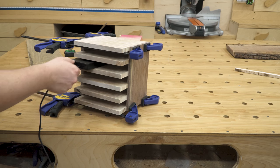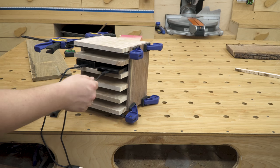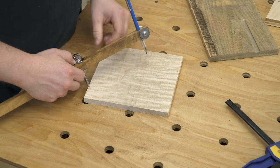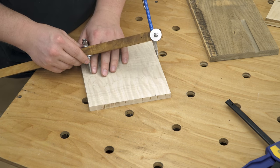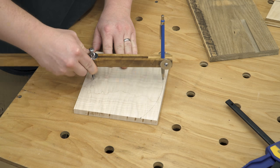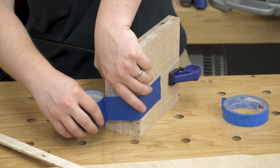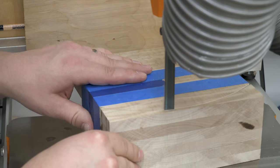After another quick mock-up of the case, it was getting late in the day and we were both running out of steam with a lot of work left to do, so we decided on a design change to simplify the front. Instead of a multiple-curve front, a single curve would have the same functionality of exposing one hard drive corner while still breaking up the rigid rectangle look. After determining and drawing an appropriate radius on the front of the top board, I taped together all of the pieces and followed the line at the bandsaw to cut them all out at the same time.